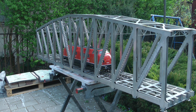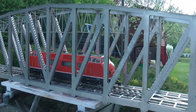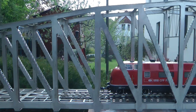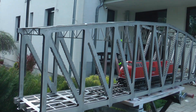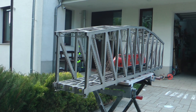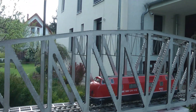I decided to print the same height for myself even though I don't need it for my gauge one stuff. I got this CNC cut roughly about a year ago and it was sitting in the garage for a long time - I started assembling it during this winter. The bridge is cut from one-millimeter stainless steel. I chose stainless because with all the intricate details I wouldn't be able to get a paintbrush in everywhere. I'm not really good at welding, so I wanted to use either gluing or soft soldering, which ruled out galvanizing.